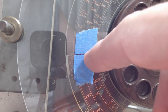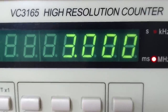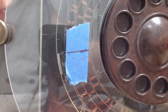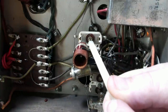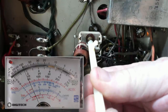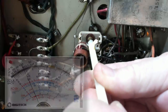I'm going to check the short wave. I've extended that mark through to this — that's 30 meters, about the middle, so I'll put it there. I've got the generator set at 30 meters; I've had to put the old valve generator on. It's right there — that's close enough. That would have been the adjustment if I was going to adjust it. I'll just trim this one up here and get maximum signal on this one.